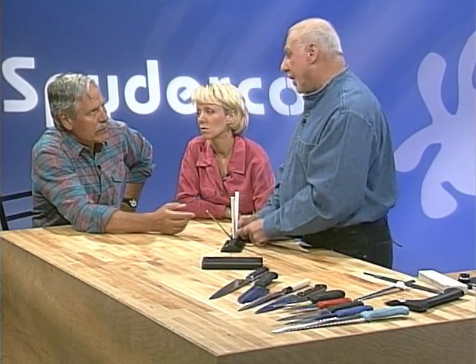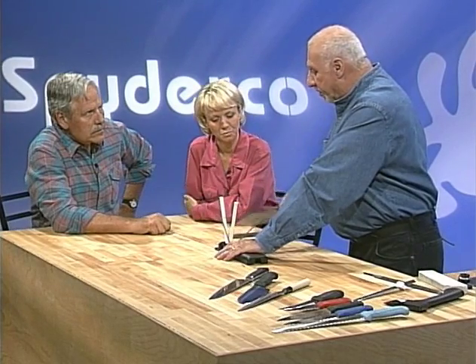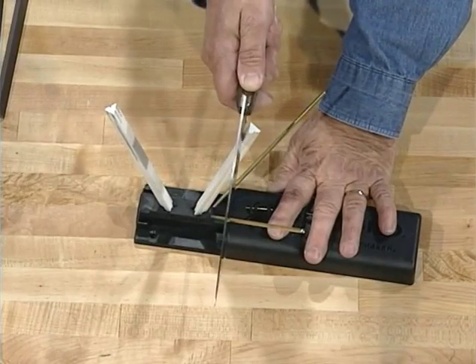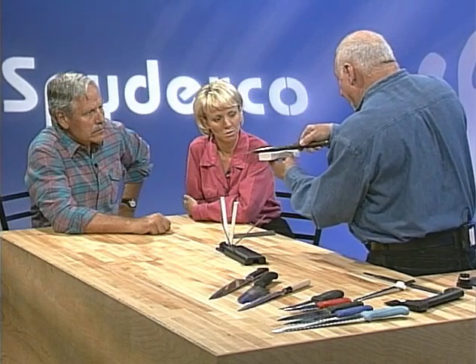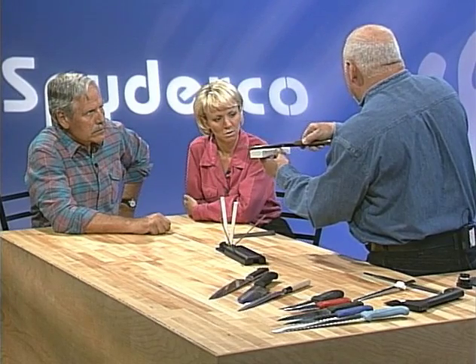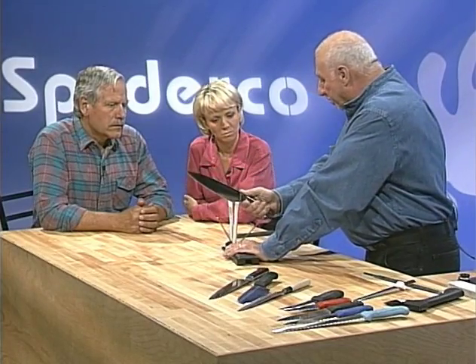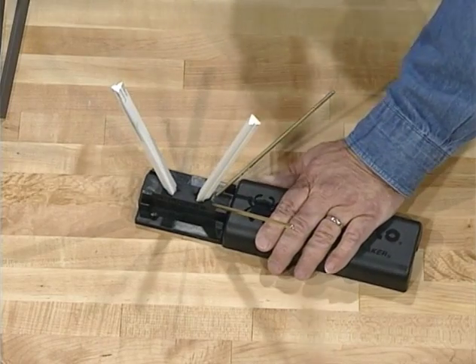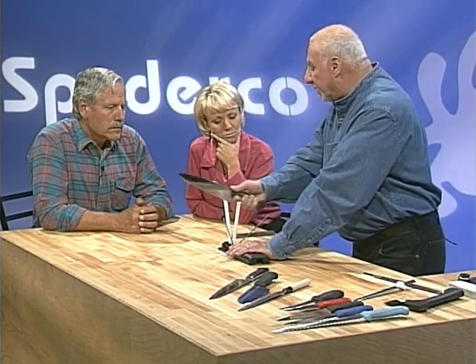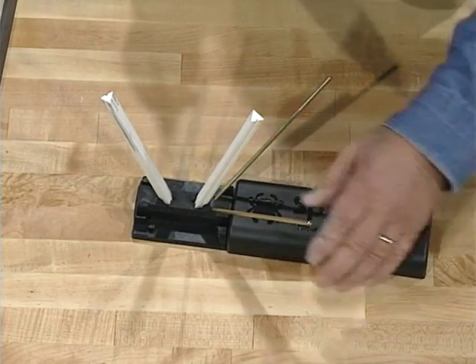The sharpening process is keeping the blade straight up and down — that's where your angle control comes from. Imagine if you were sharpening a knife: it's difficult to see what that angle may be, but if we turn the stone up so the angle corresponds to straight up and down, you've got visual control over that position. When sharpening a knife, you're going to start at the back and pull it towards you, from heel to tip. We also have guards there — it's not the beginner we worry about but the person who's already used it for a while. The guards are there to protect your hands and we'd like you to use them at all times.